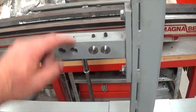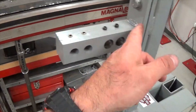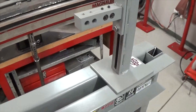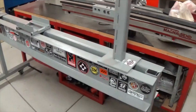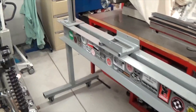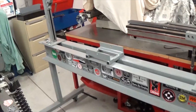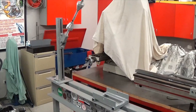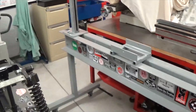Some of the designs I saw had a pair of holes so you can put two steel bars in here and clamp around the axle plate or the axle hole in the axle plate — sometimes I might use one, sometimes two. This is drilled and tapped with a little set screw on top, and that square bar is welded onto these brackets. It took a few hours to make but I figured it was an investment in the sort of work I was doing and what sort of work I'd be able to help other people with. This is not the only way to skin the cat — you can buy parts for these frame jigs from manufacturers in the US — but I figured if I was going to build frames I'd better be able to build a jig. I've used it on a few Yamaha XS650s and hardtailed three of those and it's worked just fine. If you've got any questions post them in the comments, send us an email, or look us up on Facebook. Thanks for watching.